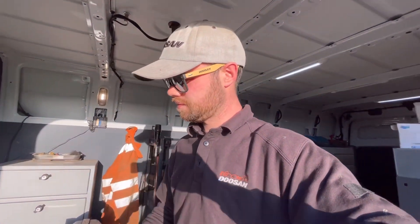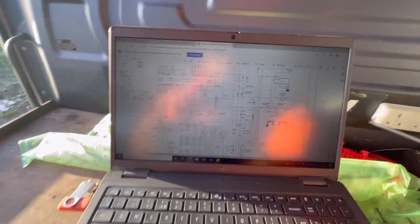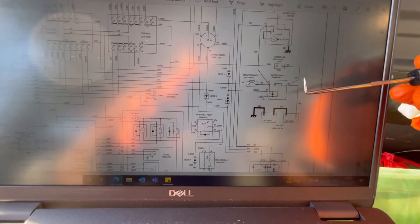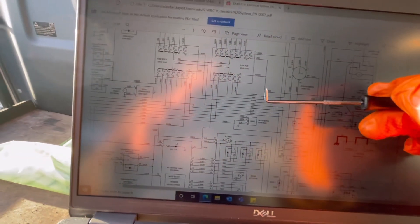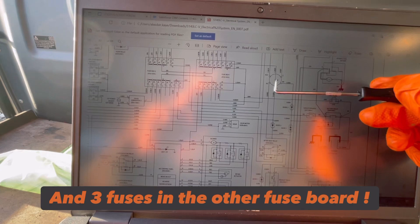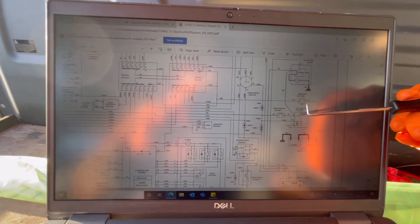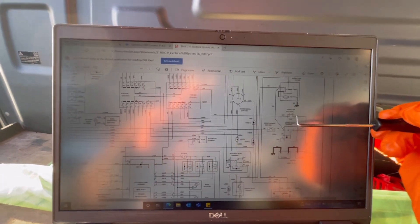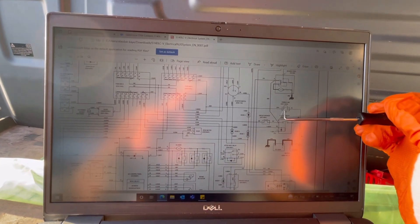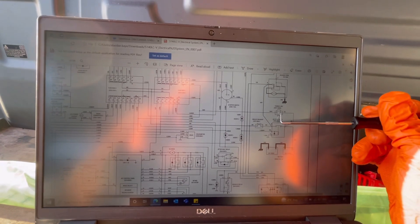I've had a quick wander over to it and it's absolutely dead, so first I'll check the battery voltage and just work my way back into the cab. I'm having a look at this wiring schematic - main battery power comes into this battery relay, but it also continues up through a fusible link and feeds these fuses, including the one for the ignition switch. When I turn the key on in the cab I've apparently got no ignition live, so first port of call is to check this fusible link in the battery compartment.